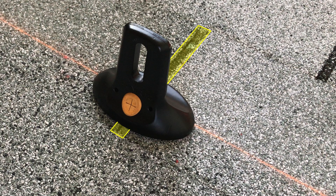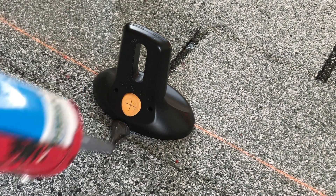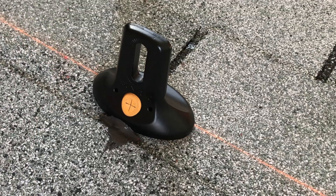When the flash lock is installed over gaps between shingles or tabs in vertical joints between shingles, fill the gap or joint with sealant between the mount and the upslope edge of the shingle course.